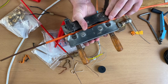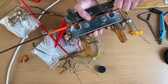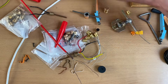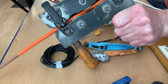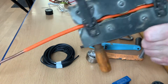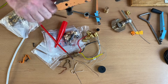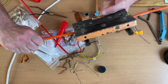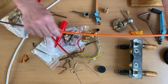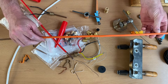Let me show how the straightening tool works - the cable goes in and is held into position. Mine is really old! In we go, clip it into place, and then what you end up doing is just running the wheels through - pulling the cable backwards and forwards through it in order to straighten it out. Hopefully you can see that's a lot straighter than it was to start with. You'll often see in exams pictures of something with a couple of three rotating wheels and a handheld device - that would be an MI cable straightening tool.